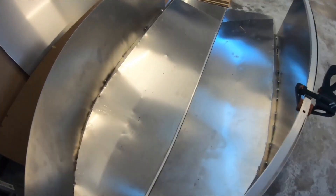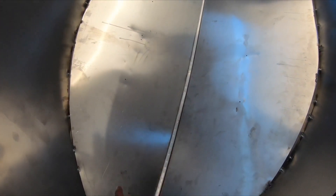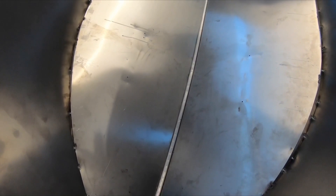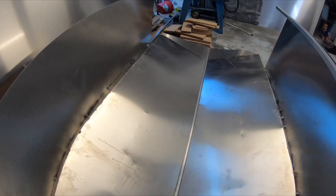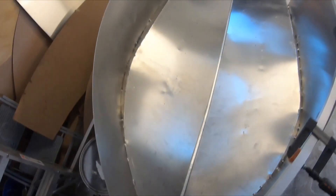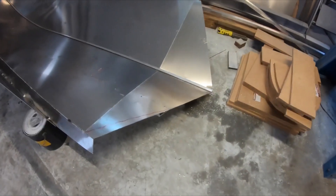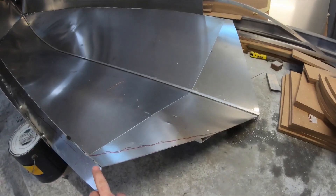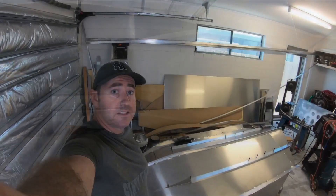What I've got running through the centre of here is a tunnel the whole way through — a 300mm tunnel which will act like a backbone basically, all the way through the hull. It's going to attach to the tail section so it'll be completely one piece once it's all attached, and structurally it'll tie the whole lot in together. On the back I'm having a tapered step, tapering back from these reverse strakes, and then I've got the lifting strakes underneath.